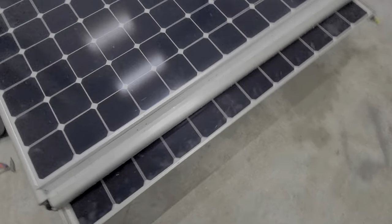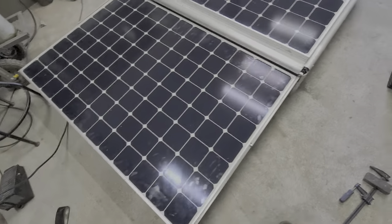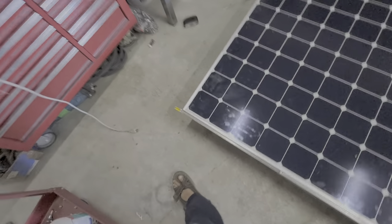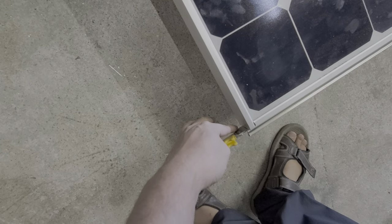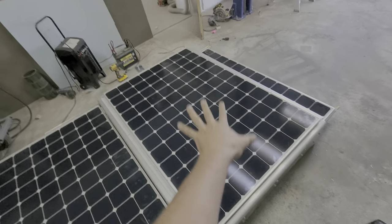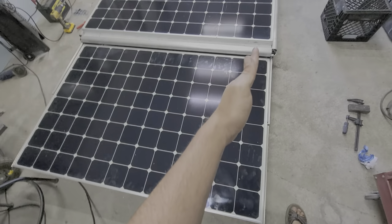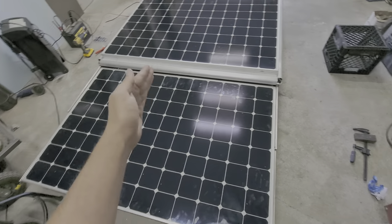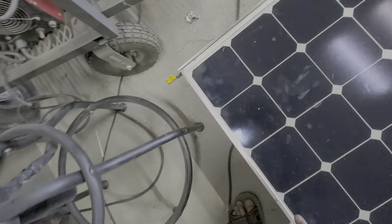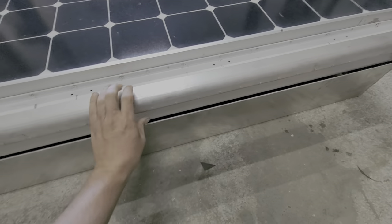Let's get it fully extended — it should lock in place. The panels are 41 and a quarter inches; we went with the 44-inch slides and didn't go all the way out to the edge. Having one on each side is important to distribute the weight pretty evenly. They do lock out, but these slides are very finicky — if it's at all not square, not even, they seem to have trouble locking. So getting it square is going to be important so that it will lock in inside.